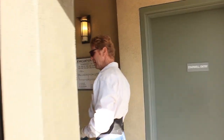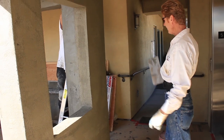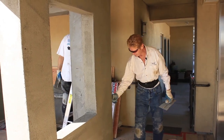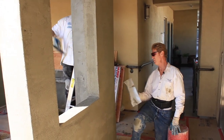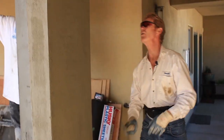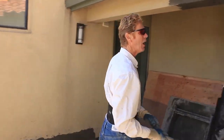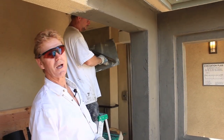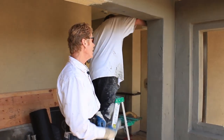All these corners aligned with these corners. I was telling the contractor about this elevator — we wanted to do this before the weekend, but today's Friday, and by Saturday somebody already bumped this. You do all this detail corner work and then somebody bumps right into here with a couch, a fridge, a keg of beer, what have you. So we just take a little bit of mud where this big hump is and fill that out. We went ahead and scraped out our expansion joint — took a trowel, scraped it down, cleaned it right up. We think boss hogs! Anyway, we're all done. My name is Kirk with Kirk Giordano plastering. We thank you guys for watching, and as usual, we'll see you guys on the next one.